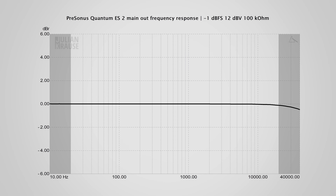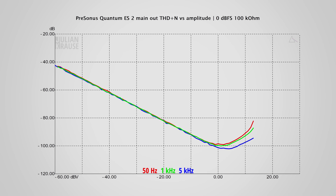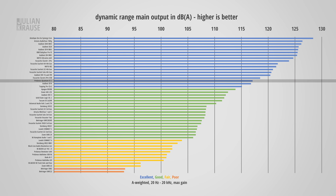Just one word of caution: I noticed that when turning the gain down further than 0 dB on the line inputs, this did not prevent the signal from clipping. So if your signal is already clipping with the gain at 0 dB, it will still clip if you turn the gain down further. Jumping to the main output side — here we can see a very flat frequency response, which is great. Distortion performance is all right; from a technical perspective one can achieve slightly better today, but with all components below -80 dB there should be no case in which this becomes audible. The dynamic range is over 117 dB, which pretty much guarantees you will never hear any noise from the ES2's main output.